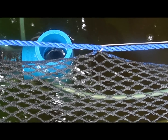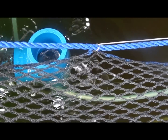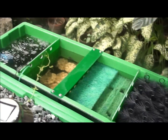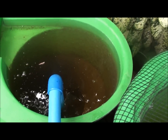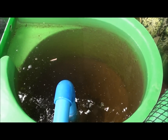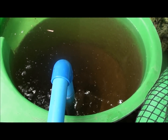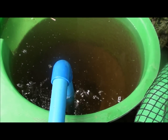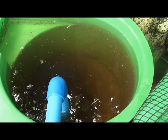Water exits the fish tank through this pipe, removing some solids and water from the bottom and lets it overflow to the next module which is the Maid 5,000 liter capacity filter module. The first compartment of the module is the swirl filter. Water enters through the pipe and creates a tangential or swirling motion which produces centrifugal force and lets heavy solids settle at the bottom.